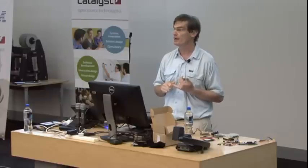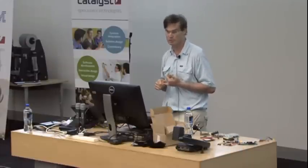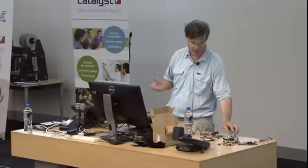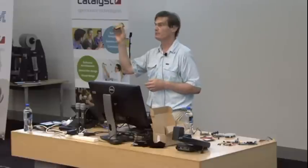And they're not done with DMA, in case anyone's curious, because the DMA setup costs are too high. So you're better off just hitting the register of the peripheral to get it to do the transfer and then waiting for it. This BeagleBone Black, despite the fact it's a very slow board, this sort of board takes 5 or 6 hours to build the Linux kernel. It's not a fast processor, single core. It can happily handle, through the user space SPI dev interface, around 4,000 SPI transactions per second with a 25% CPU load and no lost packets, which is pretty good.